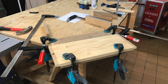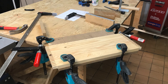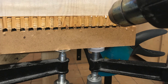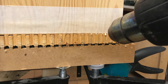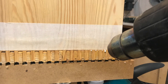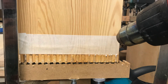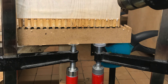The hardest part is obviously when you have to assemble two joints and two sides at the same time. I ran into some issues because my finger joints were really tight and I got stuck in the middle of the glue job — the glue had dried and I wasn't all the way in. So I had to use a heat gun, which heated up the glue and re-enabled the joint to move until it was fully seated. It was a bit of a relief when I saw it moving again and going all the way down.